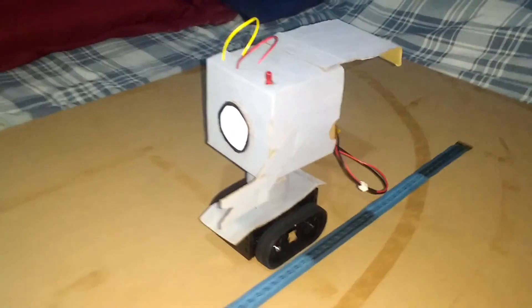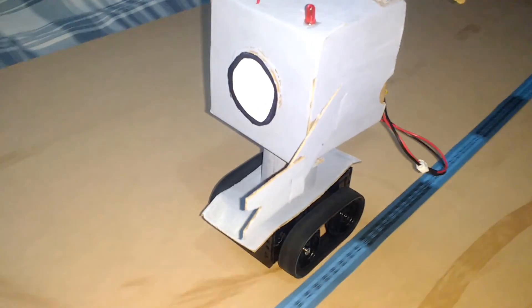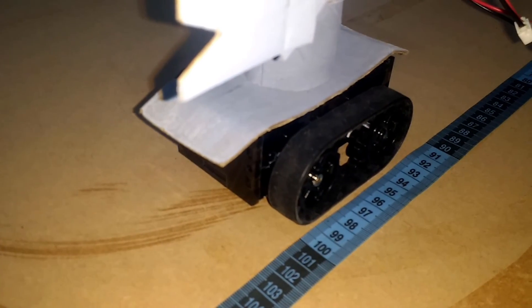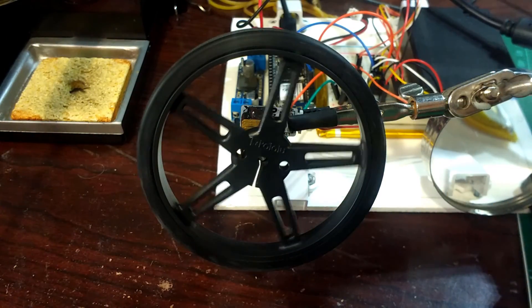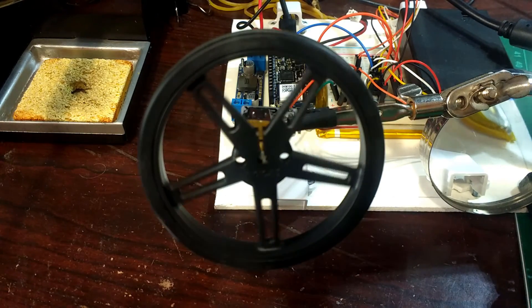SAMI is capable of driving the motor for a desired distance or angle and then stopping automatically when it's reached. A PID control can also be used with this function. This will be ideal in robotics and simplify a lot of hard work in making precise movements.